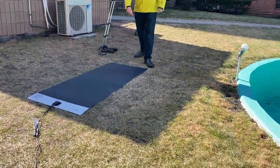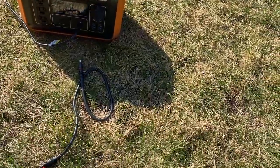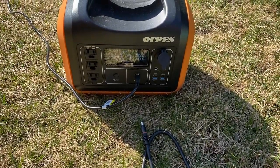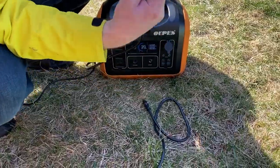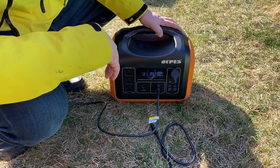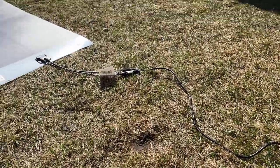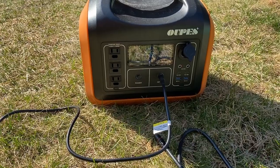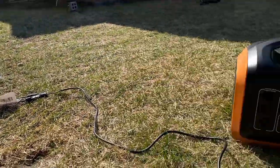With the panel going into shade, we're getting zero watts. Now testing the CIGS panel — connecting it in the sun. We're getting 70 watts lying flat. This is the CIGS panel, 160 watt. Now putting some shading on it — it's going to zero. We're getting zero to one watt. About 20-21 watts in partial shade.